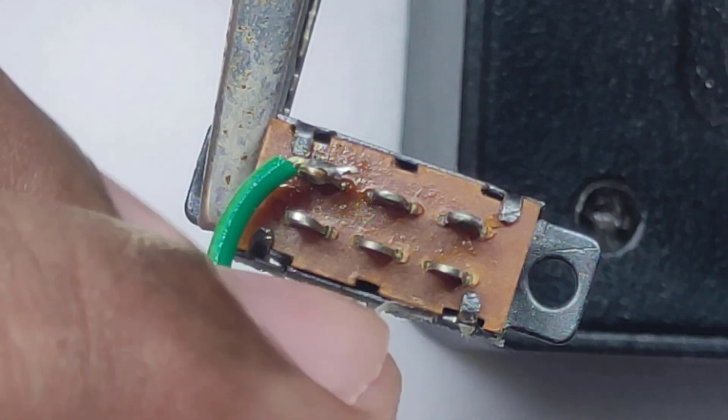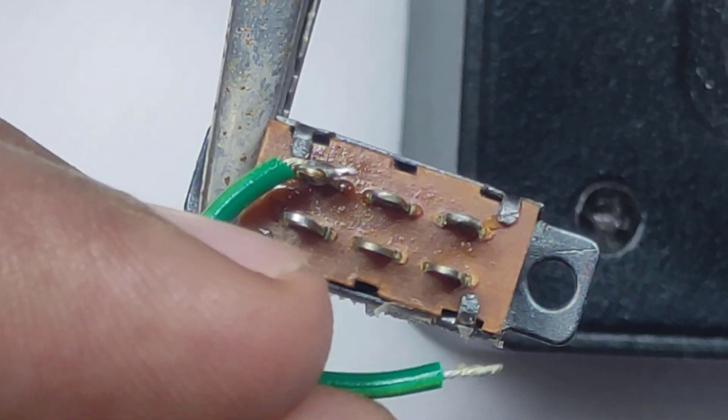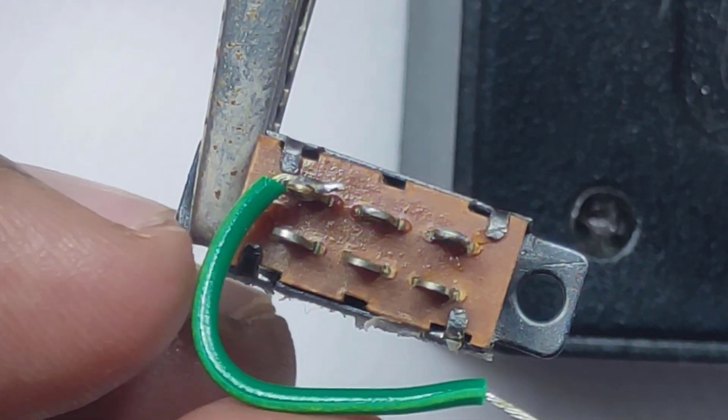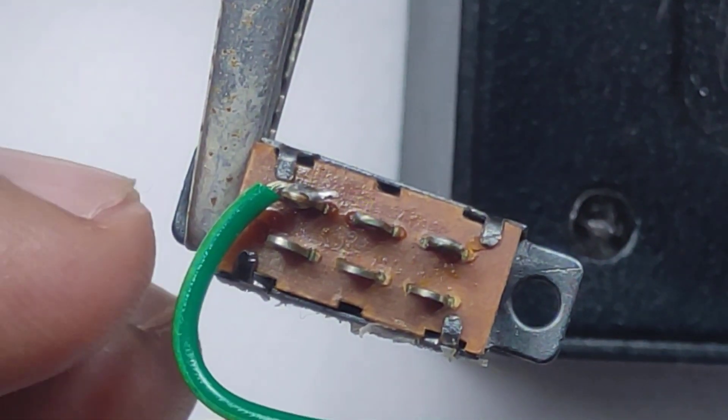The wiring diagram is given at the end of this video. The DC motor can only be controlled using this circuit. Slide switches cannot carry high current, so this type of switch can be used for changing direction of low to medium power motors. For high power motors, H-bridge is the better choice.